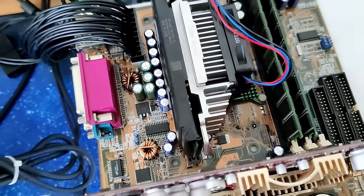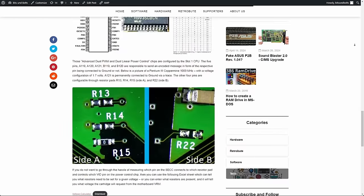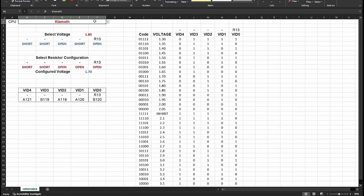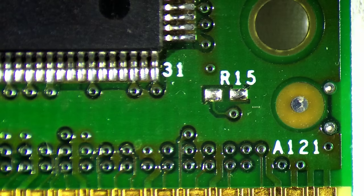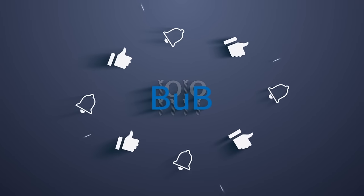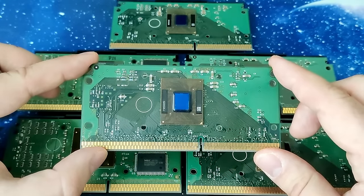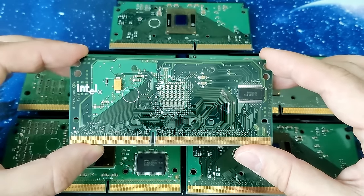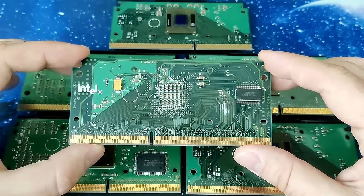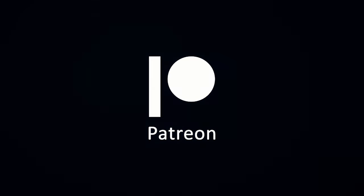I am really curious to read your ideas in the comments. And if you want to get a copy of the Excel sheet, please visit my website from where you can download it. I may update the sheet once I get more CPUs and their layouts. Unfortunately, the resistor names change from generation to generation and even from model to model, so there is no guarantee to find the exact designation of the resistor pads in the Excel sheet. Some models like Deschutes and Katmai have only one place to add a resistor, but different names on the silkscreen. I hope you enjoyed looking deeper into Intel's Single Edge Contact Cartridge and how it communicates with the motherboard what voltage to supply to the processor. Also let me know your guesses what model this is — I hope we will be able to get it to post with the help of your ideas and suggestions. Thanks for watching and I will see you in one of my other videos.